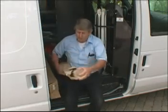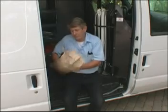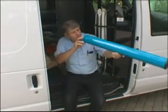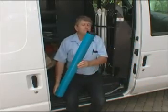It should also be noted that directional antennas limit future growth of the mesh network and prevent the wireless router from repeating signals to other units. They should be used only where an omnidirectional antenna will not work.